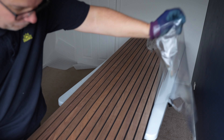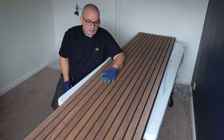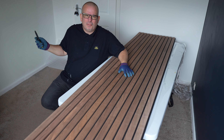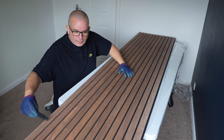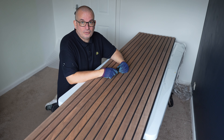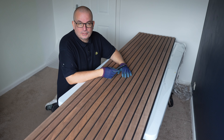Let's get this unwrapped, then we'll measure up, mark up, and start to cut. This is a real wood veneer, so you can oil it — it comes pre-oiled but you can oil it in future, just treat it like any wood finish. I need to measure carefully and mark at three points: one end, the other end, and the middle — draw a straight line across and then cut. You can use any kind of saw; I'm going to use a very fine tooth hand saw.